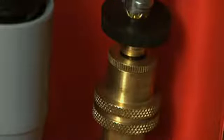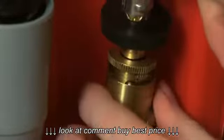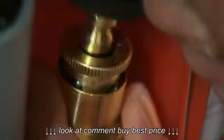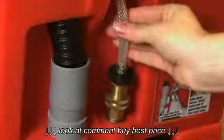If it's loose, simply pull down the spring-loaded ring on the coupler until you can see the silver ball bearings. Then push the connector on the hose back into place until the brass connector has snapped fully back into the closed position. Check this is locked in place by gently pulling on the braided hose.